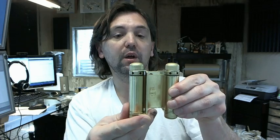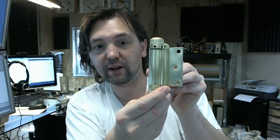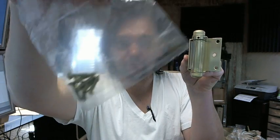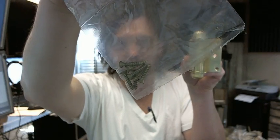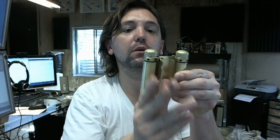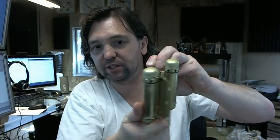Important to know, the three inch covers the range of three quarter to one inch. The door leaf simply surface mounts to the face of the door, so your door is going to set into here, and then those screws — by the way, screws are included, painted to match, number five by one inch flathead screws. This barrel will handle the spring loaded aspect of the door opening up out this way, then of course the back side is handled when the door is pushed in the opposite direction.